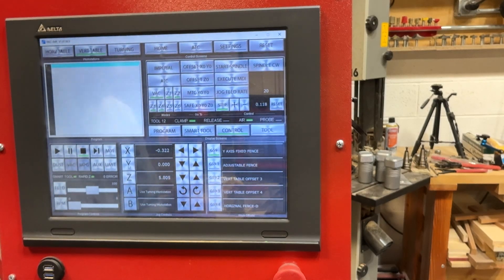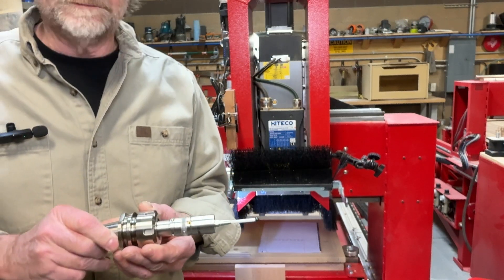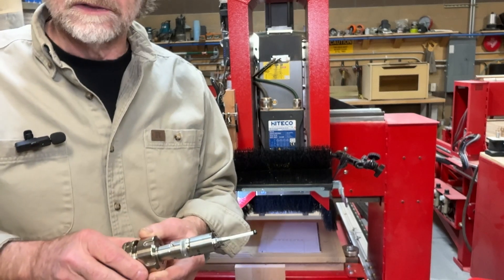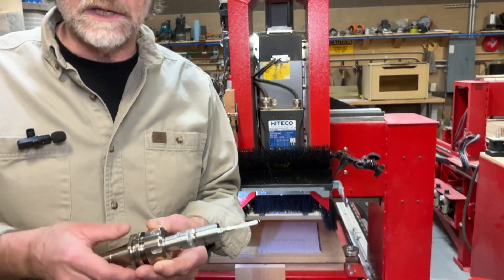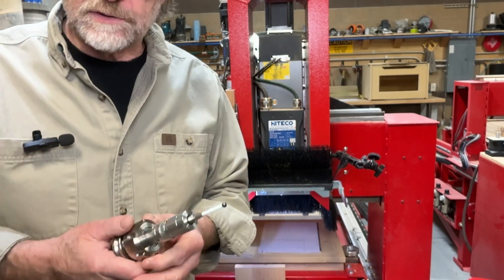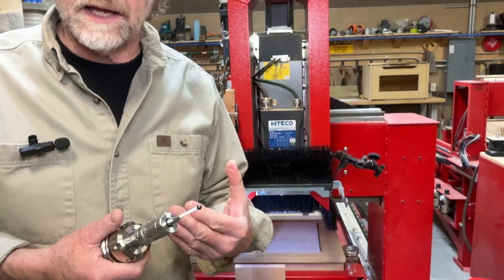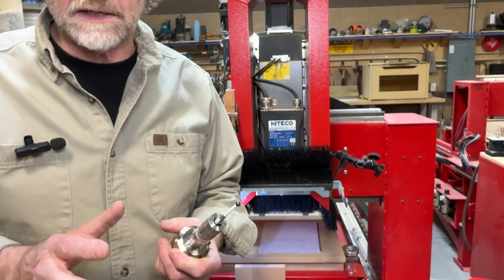Now I repeat the same thing on the backside, which would be the X-axis. Let's just talk about this for a minute — nifty little tool. The downside, like I said, I still have to put in the offset of the ball, but it finds the edges, and because I get the beep and the light it's really easy to do my job. It's on Amazon, it's less than $150 — a good deal more expensive than $20 — but you operate exactly the same way, with the advantage of the sound and the light, so it's really hard to make a mistake.